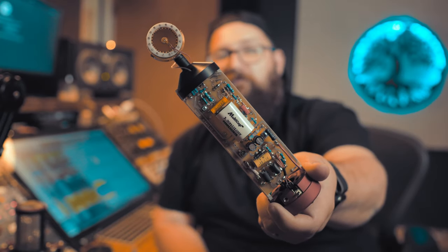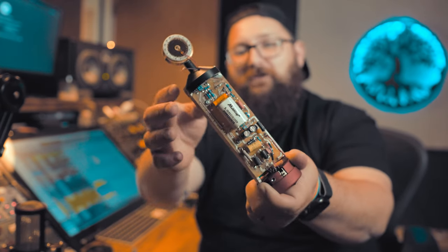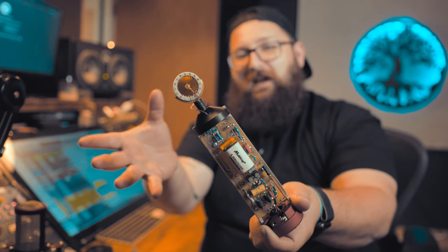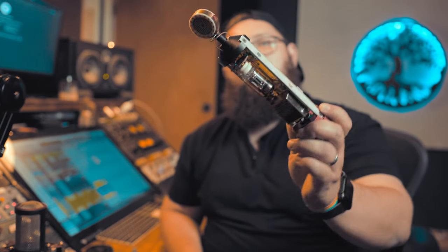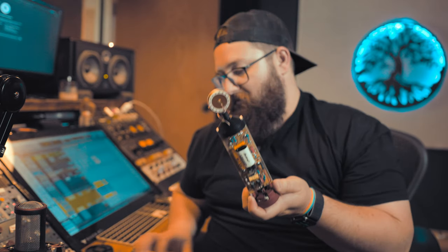And most mics look pretty much like this. If you're careful about this, you're not gonna do damage to the microphone. Only thing you definitely don't wanna do is touch the capsule or let things spill onto the capsule. So you wanna have a clean workspace to work with here. If we flip it over, there's our tube. We're gonna see if this is causing our issue.